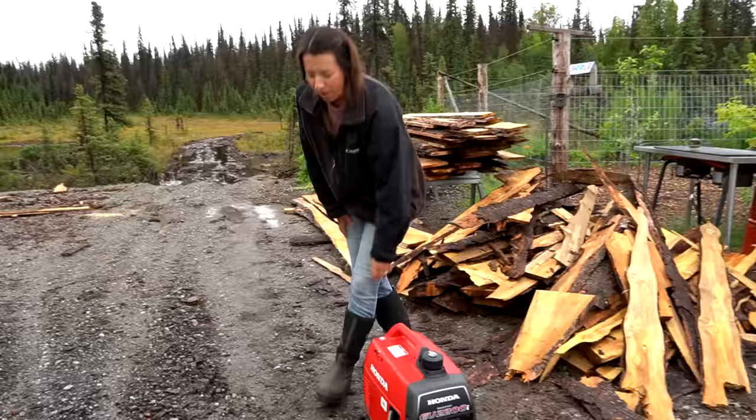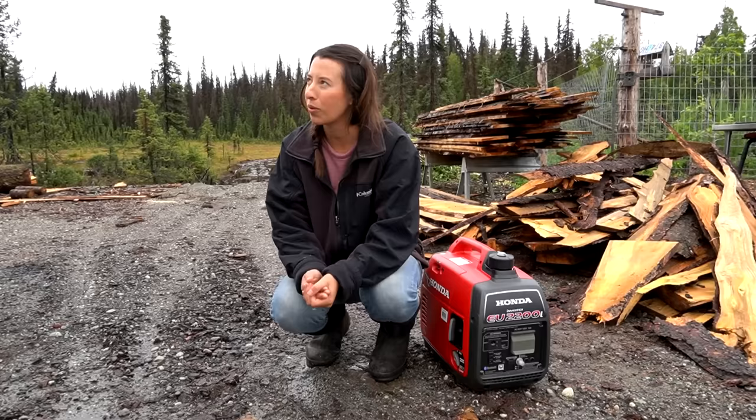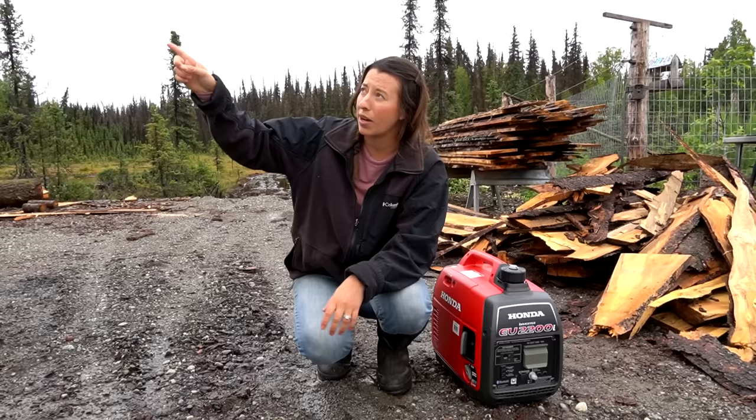Well, it finally finished raining and we are ready to get back to work on our lean-to project off of our Connex. Put a lot of work into it so far. We've got the rafters up last time and Eric's already measured where we're going to be putting the one bys that we're making in order to screw our roof panels on.